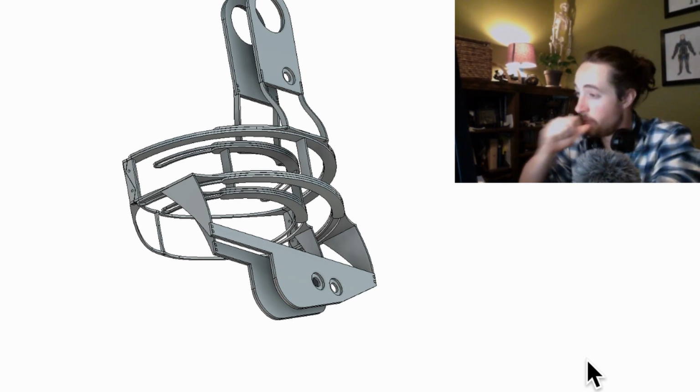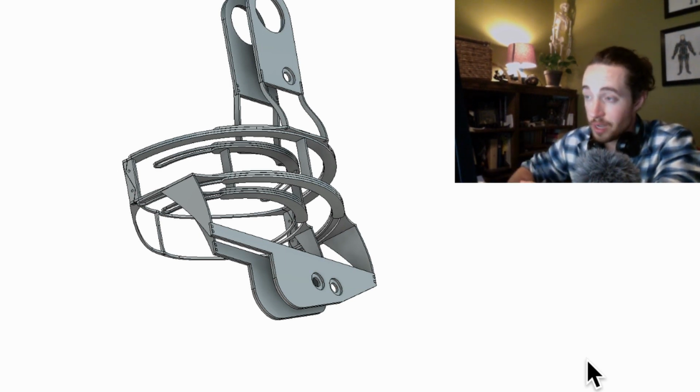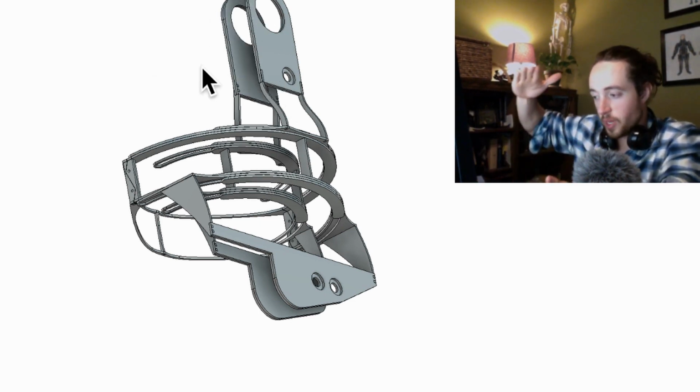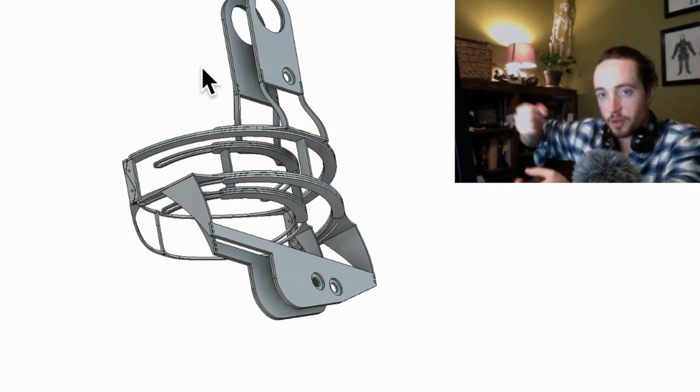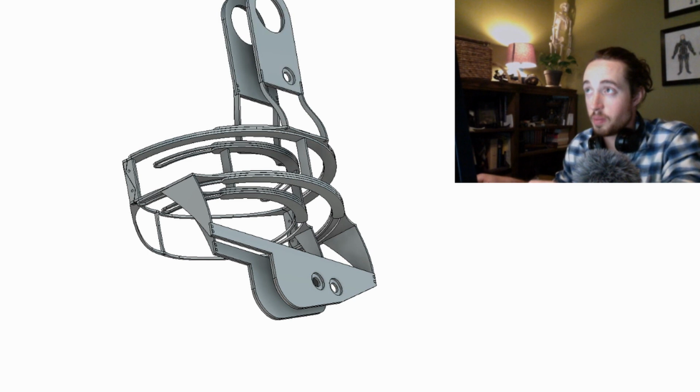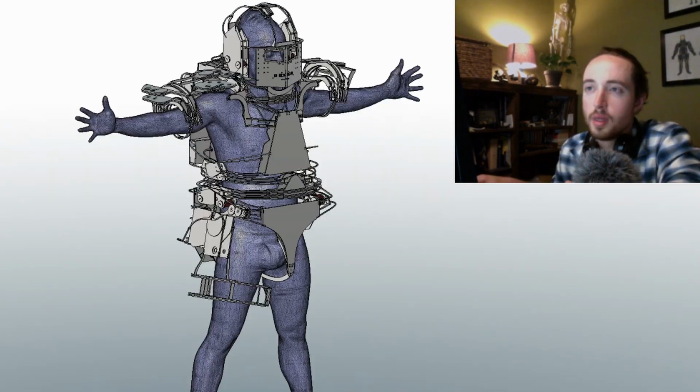They would literally shear apart titanium if they were just on the outside of a solid piece of type 5 titanium, which is a very high strength alloy of titanium, stronger than a lot of stainless steels. It would still shear it. I mean, it would just completely bend it like it was nothing with 5 tons of force. So very important that this is supported on both sides, kind of like the force being confined to the inside of a pipe versus on the outside of a bar. The outside of a bar obviously is going to be a lot easier to bend than the inside of a pipe.